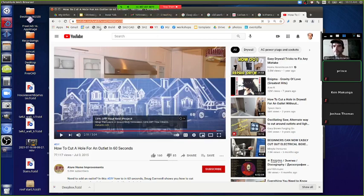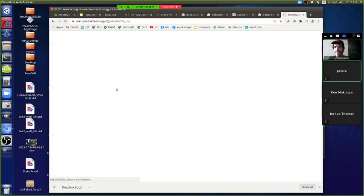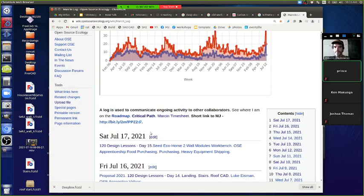So that's old work boxes. But we've got to be above our interior electrical channel blocking, and that is 1.75. So we have to be at least 1.75. Give it another inch for the tab, so like 2.75 or just 3. So next person, let's locate that electrical box 3 inches up and put it next to the stud.